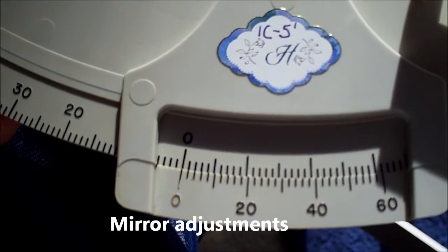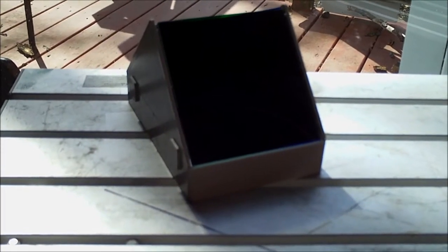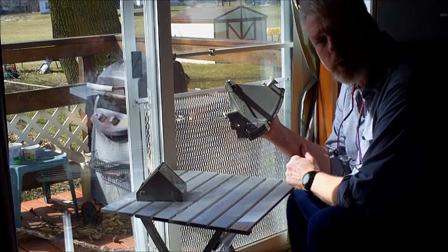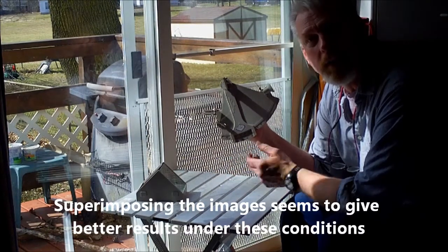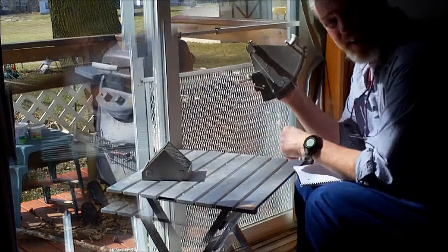The first thing you do is make adjustments to your sextant to eliminate as many errors as you can. I sight on a tree in the distance and it gets pretty close. Since I do not have a handy body of water for sightings, I am using a Davis Artificial Horizon, and I'll be sighting on the sun today. There's a tree in the way right now blocking the bulk of the sun, but later as the sun moves I'll get a better view. I'm going to take a total of six sightings with each sextant — three will be lower limb if the tree branches cooperate, and the other three I'll superimpose the images of the sun over each other and average those out. So I'll basically get two sight reductions from each sextant, and we will see if there is a difference in accuracy.